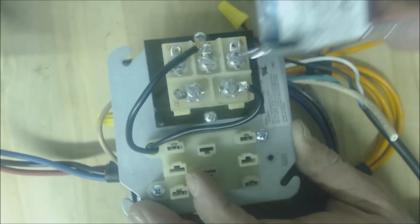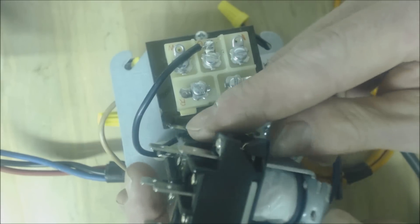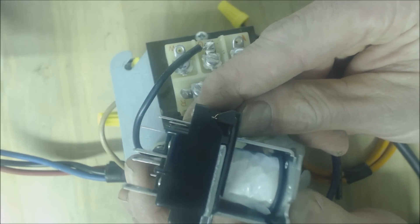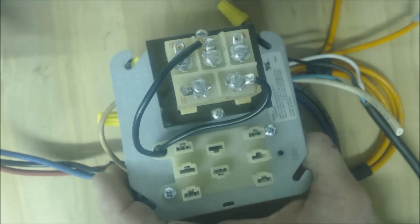In reference to this system with the fan control relay, the things that tend to break are the general purpose relay — due to the amperage being drawn through it for the blower motor — or it could be the capacitor, or it could be the fan limit control. These three items in my experience tend to be the culprits of the blower motor not turning on, at least in the older furnaces, for air conditioning and for heat.